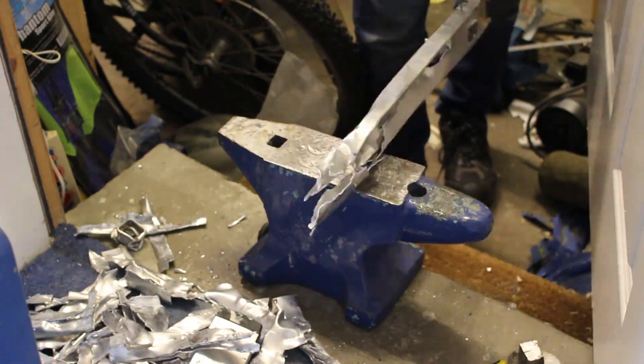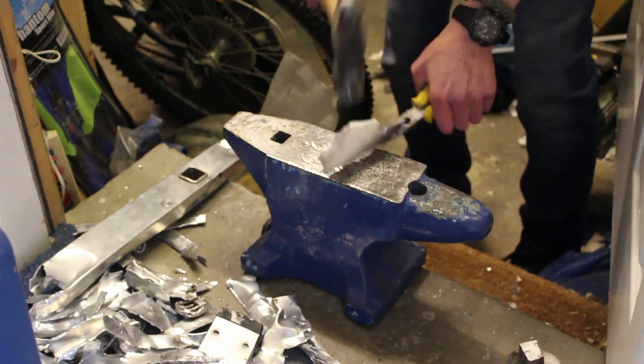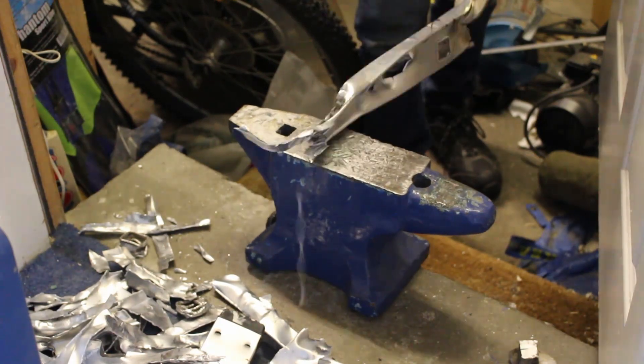The most abundant source of aluminium is fizzy drink or soda cans, but they're not very good since they're not very pure and they don't create great results. They leave a lot of slag in the crucible and I've had troubles with that in the past.